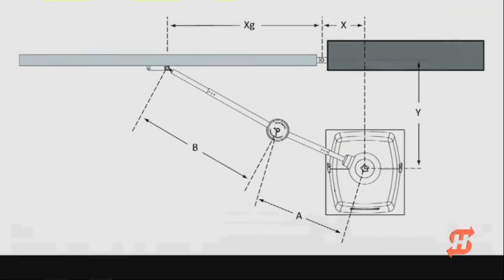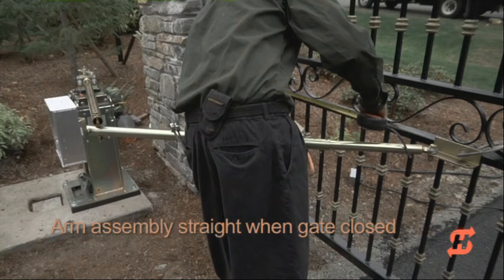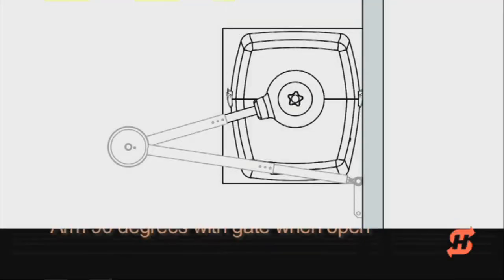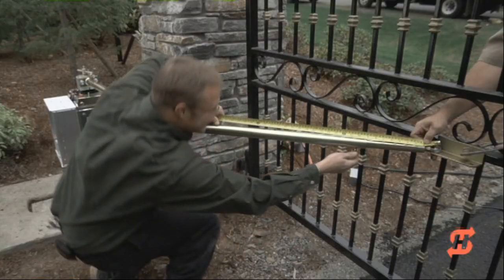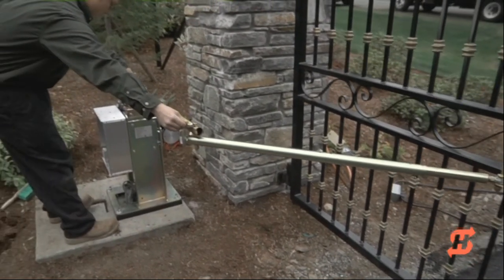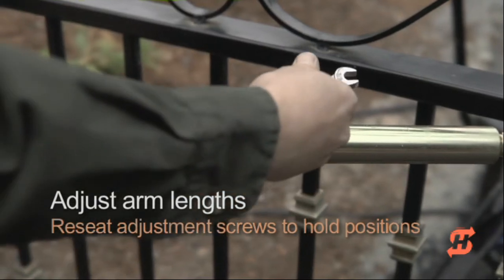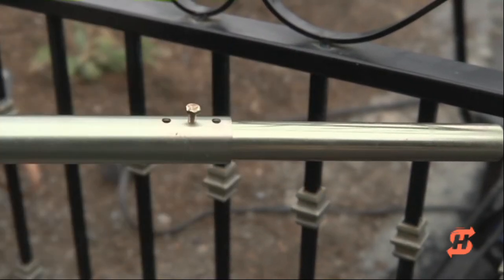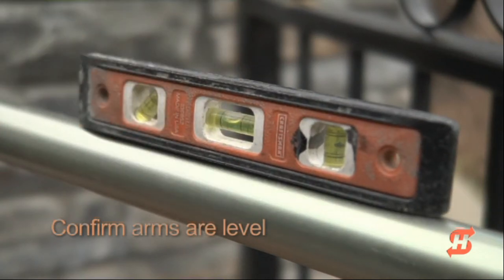Consult charts in the manual for proper dimensions of arm links relative to the operator's location. The linkage arms should be straight or with a slight bend when the gate is closed. When the gate is fully open, the arm should be at 90 degrees with the gate. Use a tape measure to verify arm links and position of the gate bracket. You can fine tune the arm links by using the adjustment screws. The screws apply pressure to the inner tube and the connection is strong enough to hold the arms in place. This lets you swing the gate and verify open and closed positions prior to welding. Check the horizontal aspect of the gate arm and adjust the gate bracket position until the arm is level.